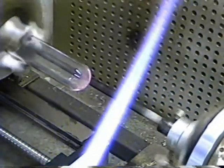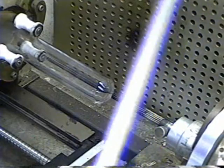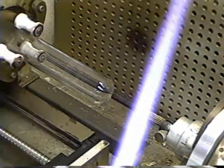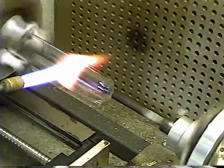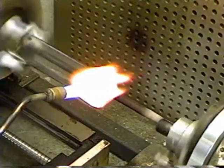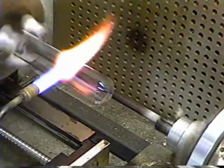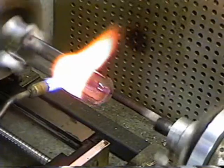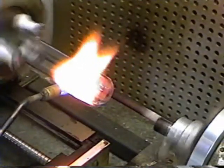Now we're going to take the end of the tube and round it off to where the end of the tube has the same body wall as the side of the tube. That way when we blow the envelope it won't be thin. Now we're going to blow the envelope. If you remember from the picture, it's a little bit longer than it is in diameter. We're going to make it about an inch and a half to two inches in diameter and about two and a half inches long. We'll heat up about as long of glass as we're going to make the bowl. We want the glass to be about like peanut butter — we don't want it to be so soft that it starts to run. Now I'm going to put pressure on the tube and start blowing.